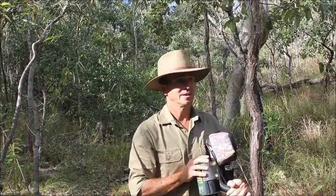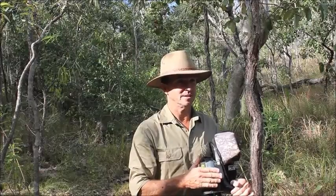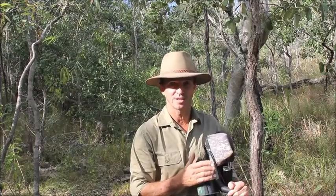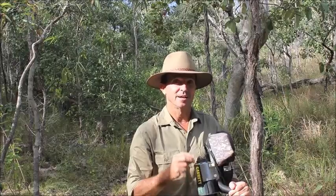But I find that with the PI machines, if you get into a really trashy old timers creek, it'll drive you mad with the iron anyway. You're better off on a VLF. But the PIs are perfect for our conditions in the really hot grounds that you typically encounter in the goldfields. It's pretty much a set and forget machine in that respect.